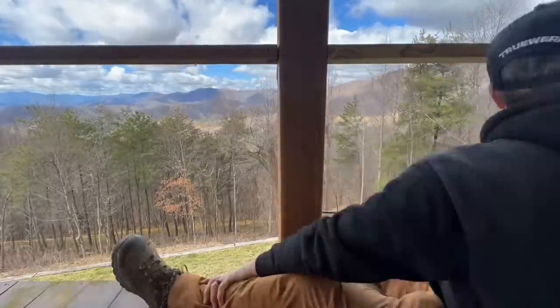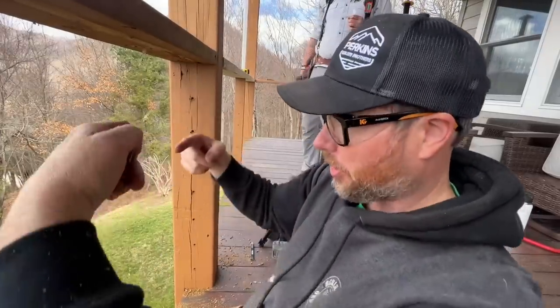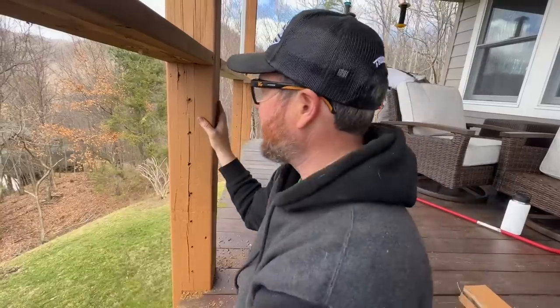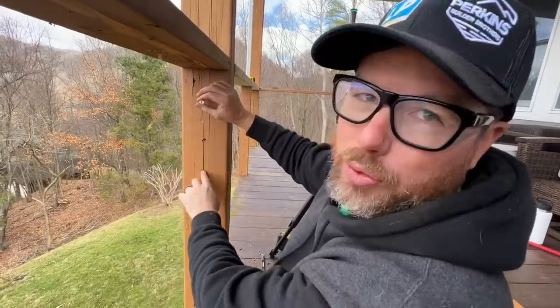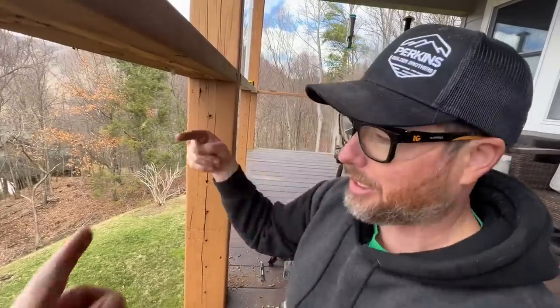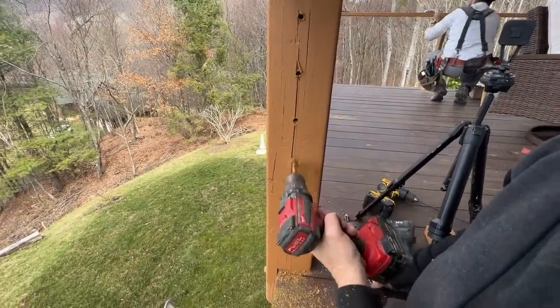I drilled through this post from both sides and that was way harder — it was almost impossible really to even make them connect from both sides using your eyeball to plumb and level the drill and all that. I drilled through a couple of spots where it wasn't the same spot on the other side thinking I was going to come out the same hole and I didn't. Also, we're going to use these post protectors. So we need to bore out the very ends of these holes to three-eighths. These will go in and kind of cover the gnarle of the edge of these holes. It has a little shoulder on it. That'll make it look nicer. This is pretty challenging though — drilling through and hitting. I think maybe we should drill from both sides with this thing.